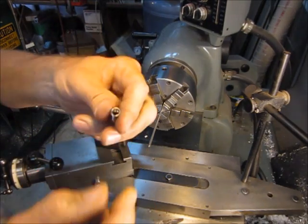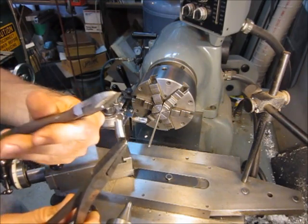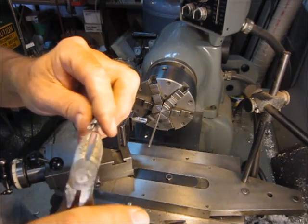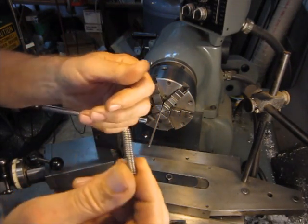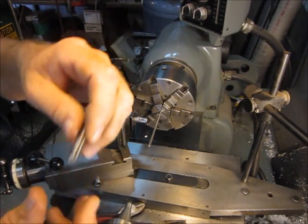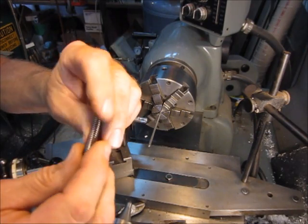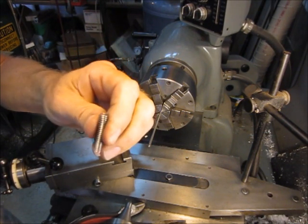But what if we want a compression spring? Well, that's pretty easy. Grab onto these nice loops you just made with your pliers, stretch it out, then clip the loops off. Now we've got a nice compression spring. That's pretty much it — it's pretty easy as long as you follow the basic safety rules. You have to make a couple of special tools, but those tools will make many different sized springs, so they're pretty versatile. There is a website with a lot of information on springs — I'll stick it in the comments section of this video. Okay, thank you.